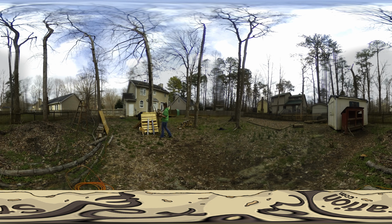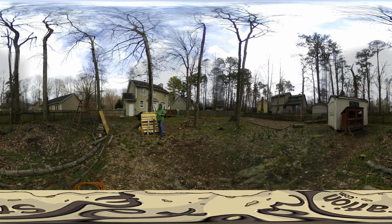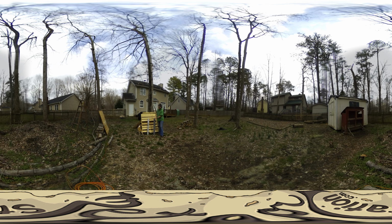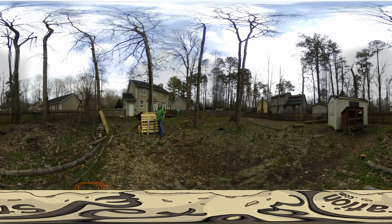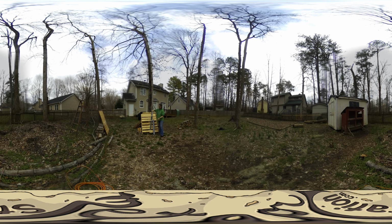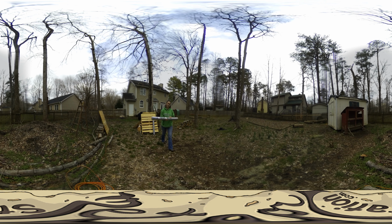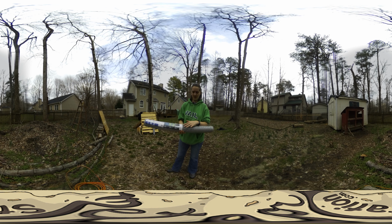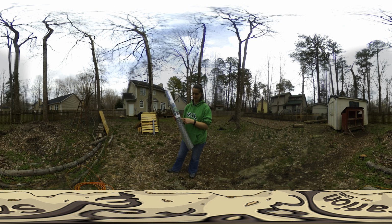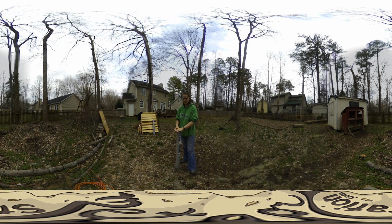These materials I did have to purchase because I tried on FreeCycle and Facebook and no one had any that they were trying to get rid of. So I got a 50-foot long roll of chicken wire. This is gonna go around the sides to keep the birds from getting out and other animals from getting in. And then I've got a roll of 1/2-inch hardware cloth. This is a metal wire. The holes are small enough that the birds can walk on them and not hurt their feet, but big enough that it lets the manure fall through to the ground below it. So it's a really good way to help keep the coop cleaner, easier.